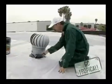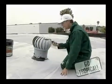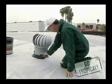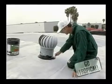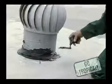You can apply the 509 using a trowel such as this or with gloved hands, either fashion. We'll seal out the bottom of the penetration coming out about 2 to 3 inches, and up the penetration 2 to 3 inches as well.